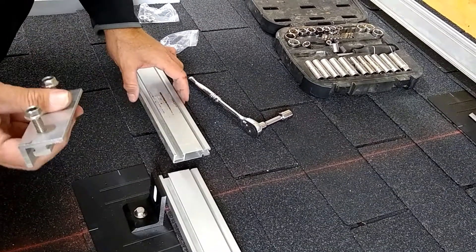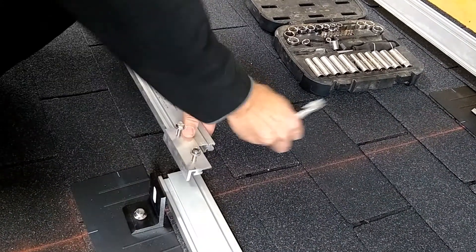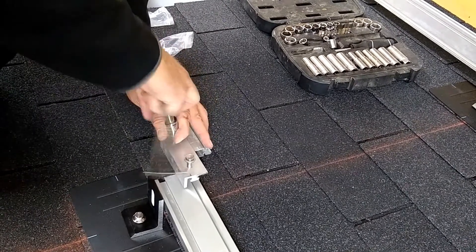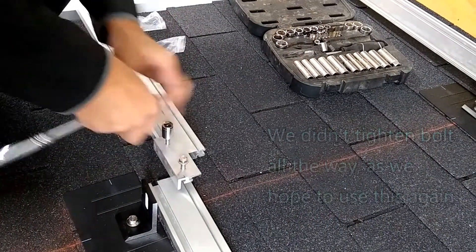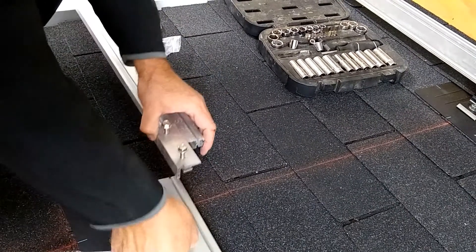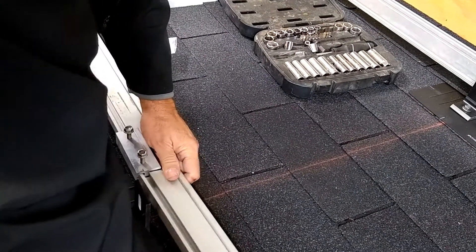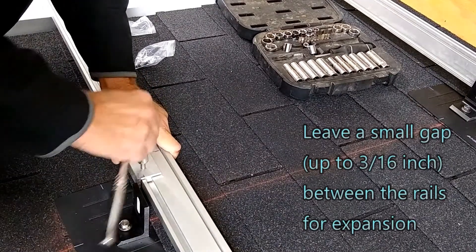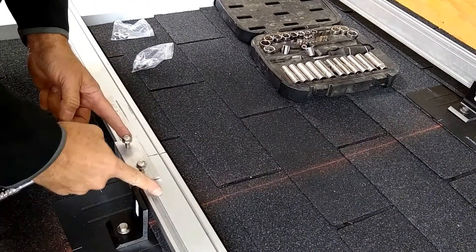On this system with UniRack, they've got a nice little splice kit. This splice just slides over, fits in the groove, put it about halfway, then we'll go ahead and lock that down. Once it's locked together, it is designed to provide a bond — there is an electrical bond between here and here, locking those together.